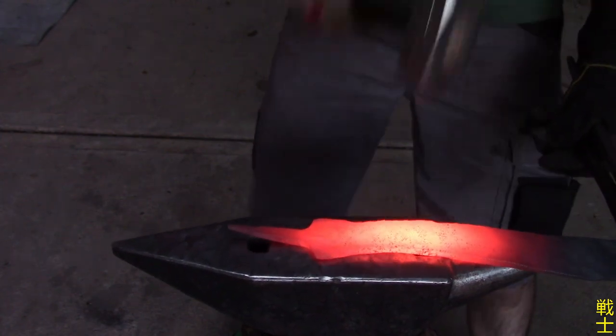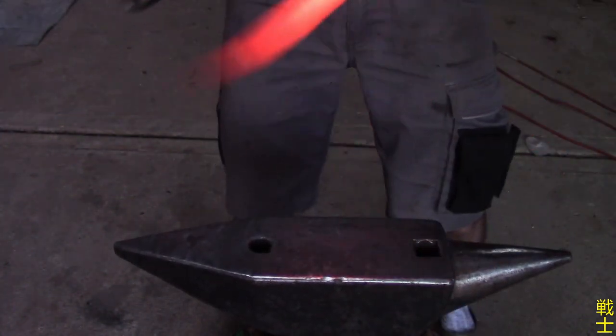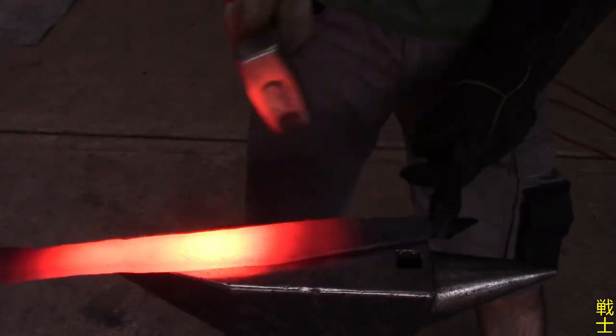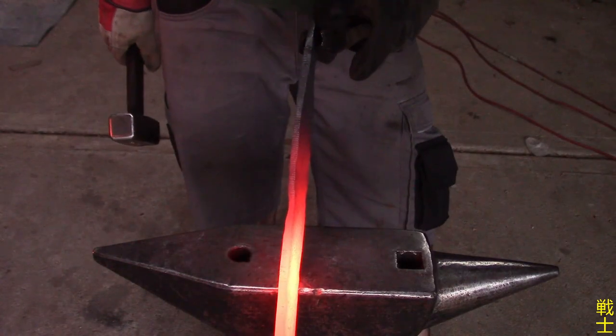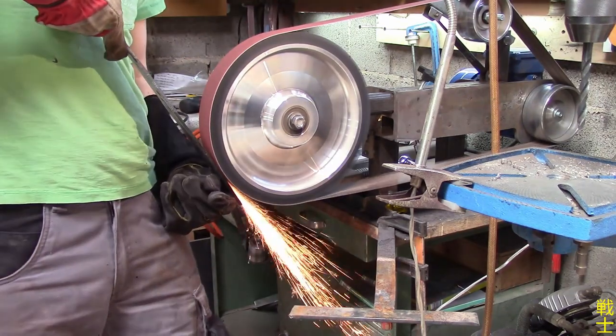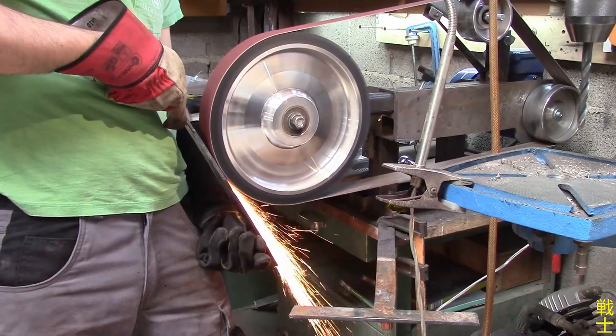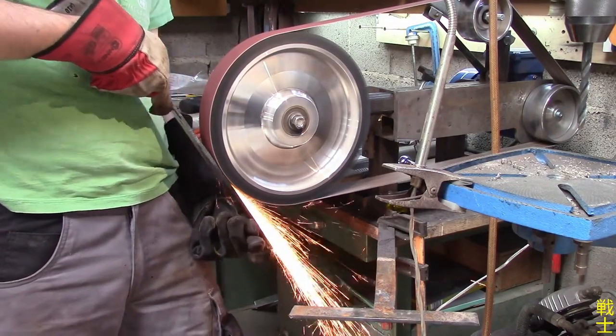After the template fitted the rough forged shape, I straightened it out and annealed the material so I could proceed with tackling the surface with my belt grinder. I used my big 30 cm contact wheel to reduce any file mark and forging residue to establish a relatively flat surface.